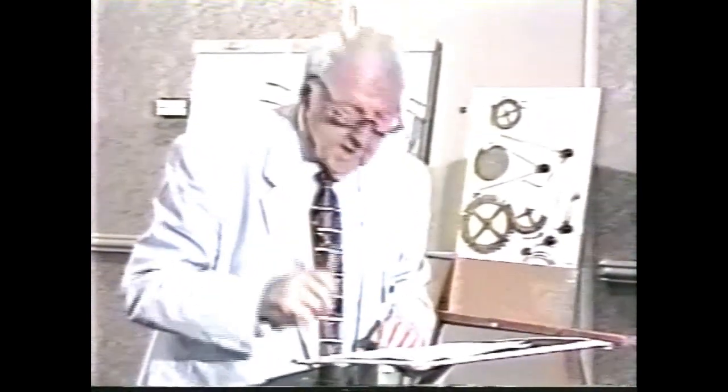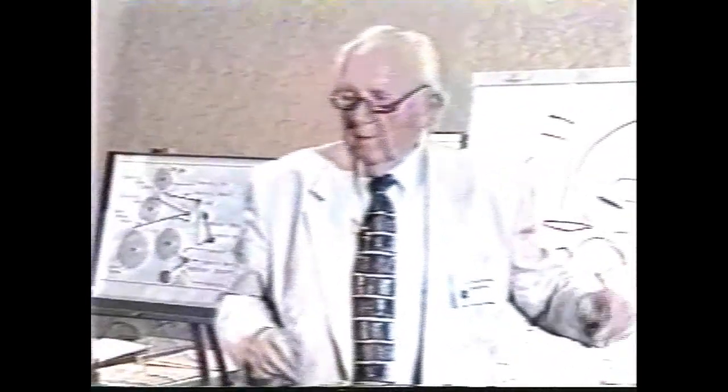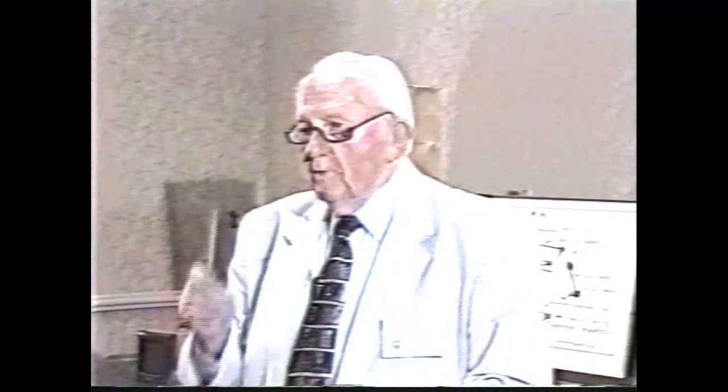This is something that I often leave out because it somehow doesn't fit: resynchronizing count wheel striking. And everybody knows how to resynchronize. You turn the hands round and round, or you take the hour hand and move it. There is a very simple way of advancing the striking in every count wheel striking mechanism, no matter where you find it, without changing the position of the hour hand.